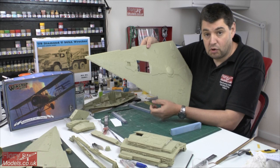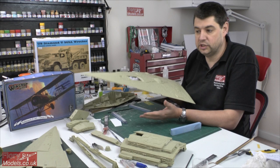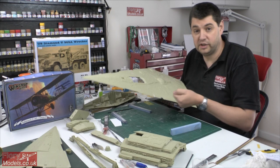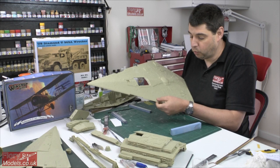Yeah, if you're going to be rescribing over something like super glues and epoxy glues, things like that, they dry so hard that it's totally different to what you've got here, that you can end up with a situation of you scribing along and then it just goes rock hard and you scratch it, you can jump off. So I prefer to do my clean up and welding actions using resins, and it doesn't shrink like filler.